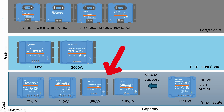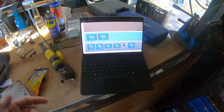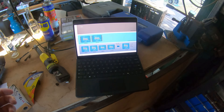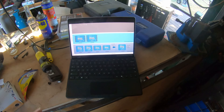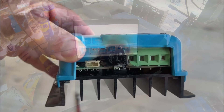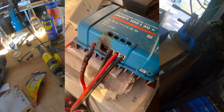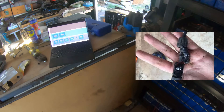Moving on to the enthusiast scale: you're getting to potential output currents that are fairly dangerous. I think even at a thousand watts, you're already in potential danger land. If you don't spec your cable out properly or you don't crimp your connectors properly, you're already in trouble. And we've had terminals melt on one of those MPPT 100/20s.